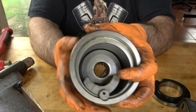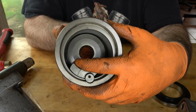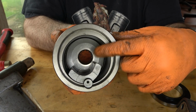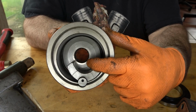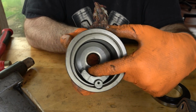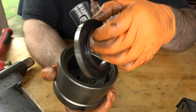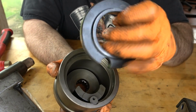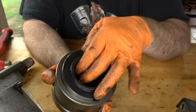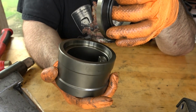It's kind of hard to screw this up because everything just nests back in place. And you can see how that hammer is going to pivot in there and engage one or the other of the dogs on the anvil based on the direction it's traveling. And this plate just rests back in there, and there's a notch that goes over this pin. And it rests back in like that. So I'm just going to lube it up and then put it back together for real.